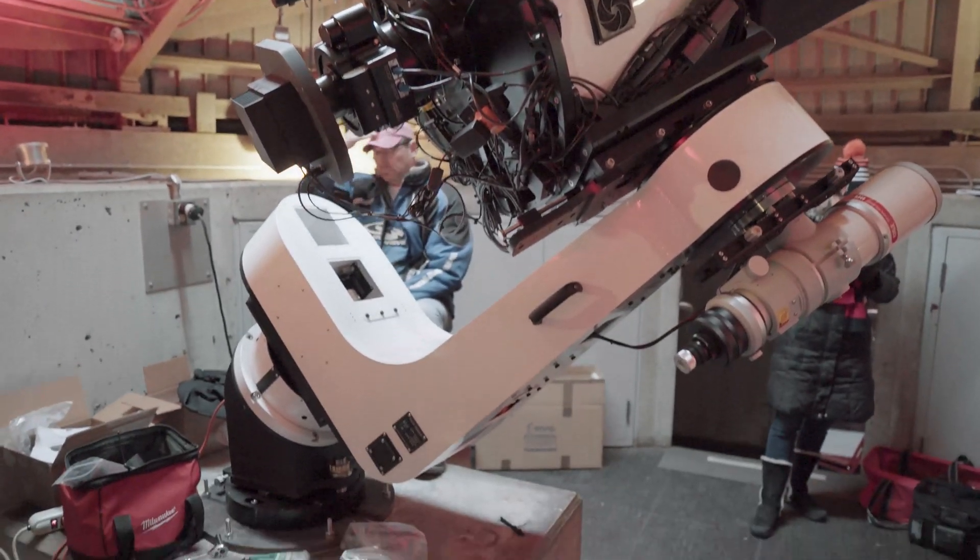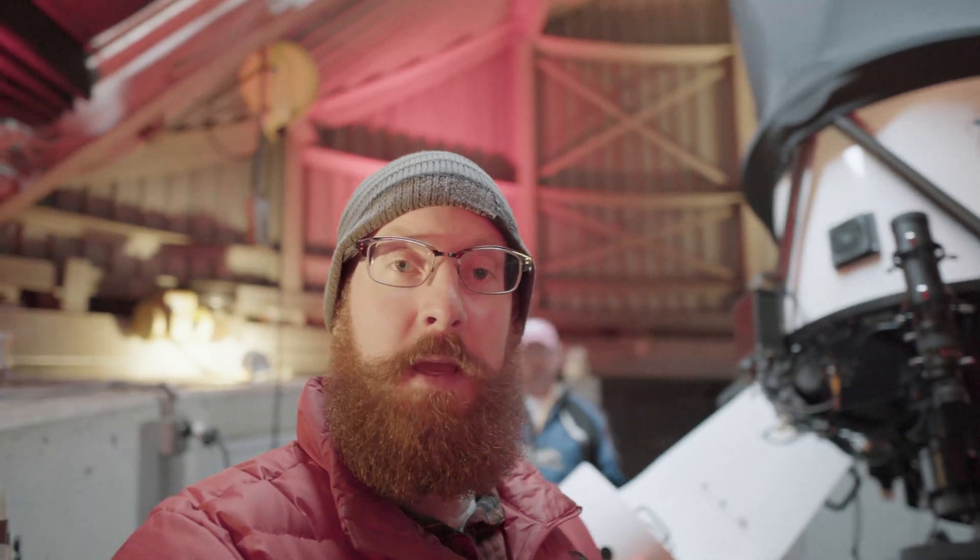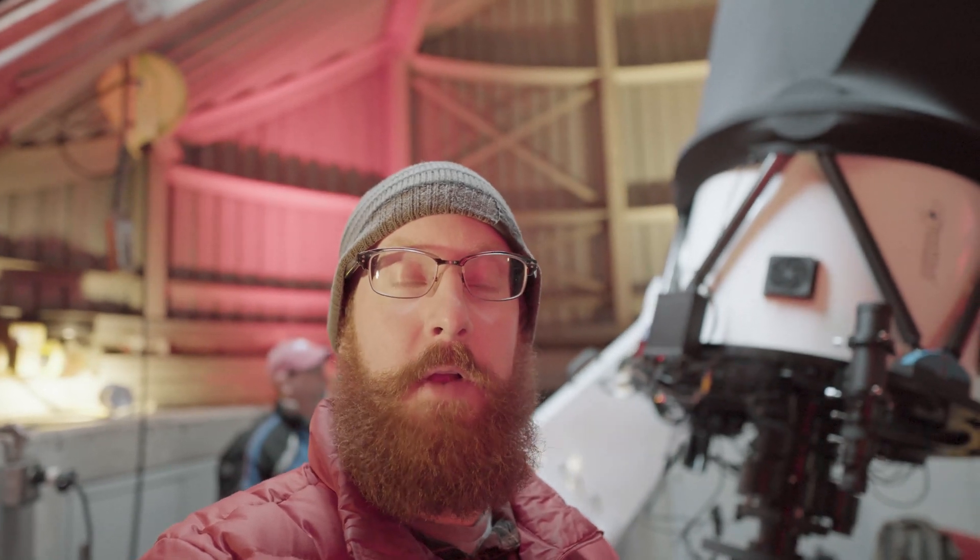The system is balanced. The final step is to connect up to the computer, test the electronics, and run our auto-tuning technique to adjust the motor parameters, and then it's waiting for clear skies and training the user on how to operate it. As you can hear, the motors are making a sweet melody and we're letting it go through the auto-tuning process — it's done two sweeps so far. It'll continue analyzing declination and then move on to right ascension. We just began the initial sweeps in auto tuner — the right ascension and declination axes are homing themselves and the software will automatically run the frequency sweeps to get the direct drive motors optimized so the tracking is right around a 20th to 10th of an arc second.